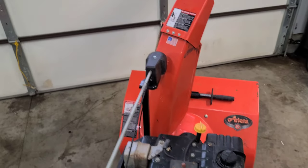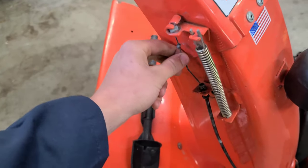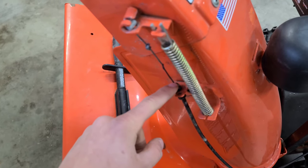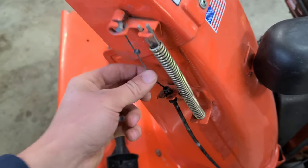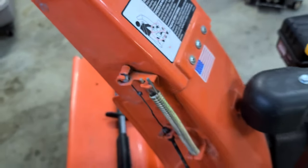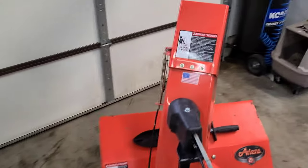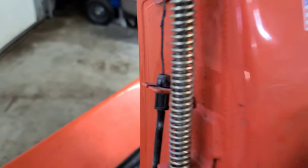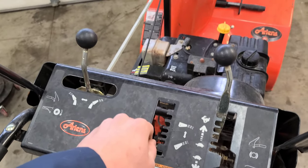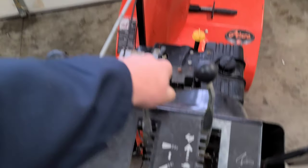As you can see this one still works, but what I have trouble with is in the winter time when I'm actually snow blowing snow, I take it with me to my route and what happens is water gets in here and it freezes the cable from moving. I had to bend it and unbend it and pull it out, and it's so frustrating. The reason it freezes is because it's actually missing a weatherproof cover that ripped off a while ago — and I didn't think that would actually affect anything, but that's why those covers are there. So we're actually going to replace the cable.